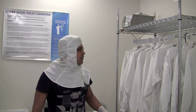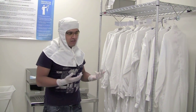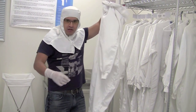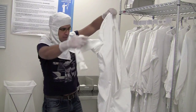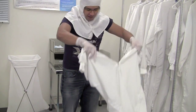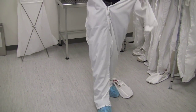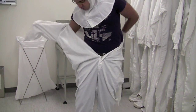The suit has a very important aspect to it — it's supposed to protect the facility from dust and contamination, so you want to treat the suit semi-sterily. A lot of users don't know this, but you're not supposed to just throw your suit on the ground and put it on. You want to make sure the sleeves — the most important part — never touch the ground. So grab the sleeves, and once it's open, put the legs in. The legs can drag on the floor; that's not as big a deal. It's the sleeves that matter, as they'll be near your work and are a big source of contamination if dirty.